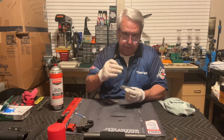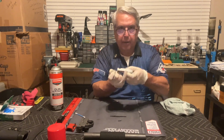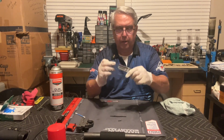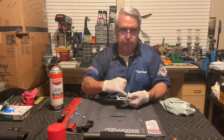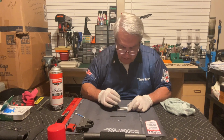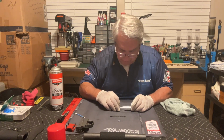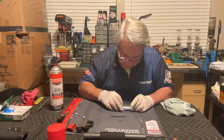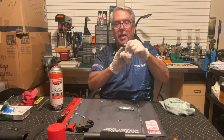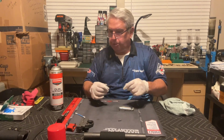In this Kid bolt, there's a little cross pin right here, about halfway down the bolt. And that cross pin goes inside. It doesn't go through, there's nothing over here, but it does go down and through both sides of the firing pin groove. So that pin wants this spring on towards the back of the bolt. So I'm going to drop that in behind that spring, push it in place with my firing pin, and that way that spring will catch right here on this notch and allow the firing pin to return to the ready position.